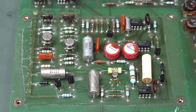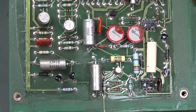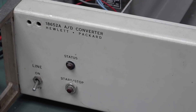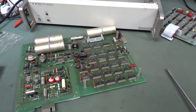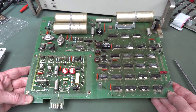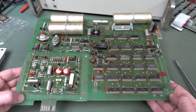Can you guess what it is yet? Should I tell you? Should I show you the front panel label? It looks like it's conformally coated — you can see the shine on that compared to the PCB, probably to stop moisture on the PCB. So whatever this is, it is a high precision something or other. Ta-da! Hewlett Packard 18652A analog to digital converter. None of this single chip or built-into-your-microcontroller ADC rubbish. This is obviously some sort of precision analog to digital converter. Because I can't find any information on this, it leads me to believe it's probably some industry-specific thing — maybe medical or research physics data sampling.